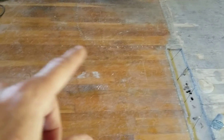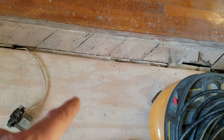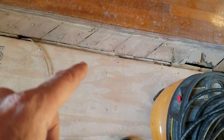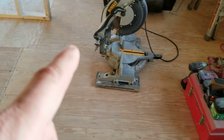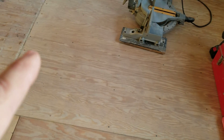So if I used Luan, I would have to put it through the entire house. What I found was there were multiple layers of half-inch plywood right here. I removed the top layer of half-inch plywood and I'm going back over that with quarter-inch plywood, and that makes everything line up perfectly.